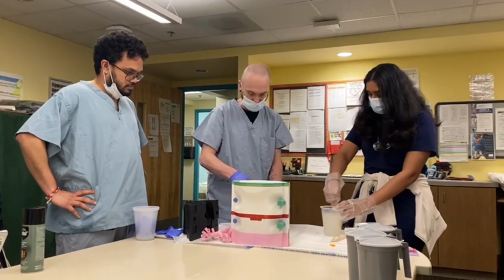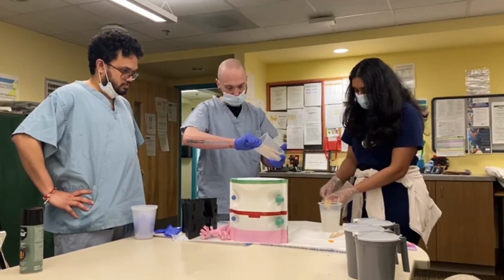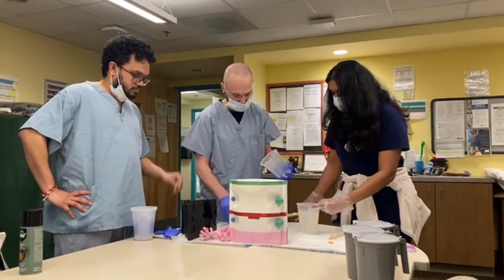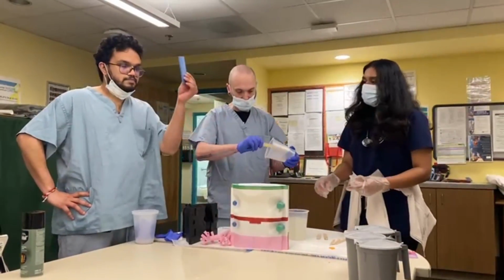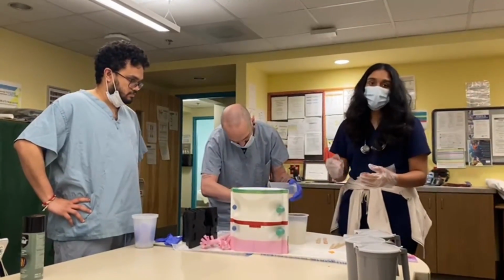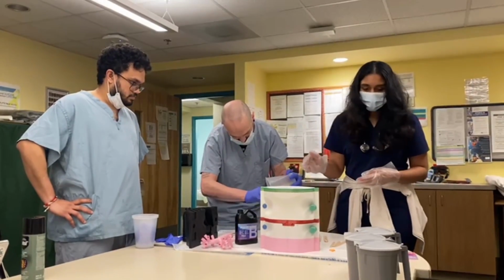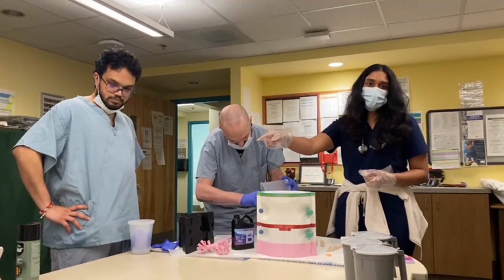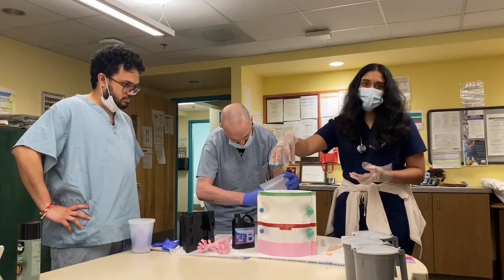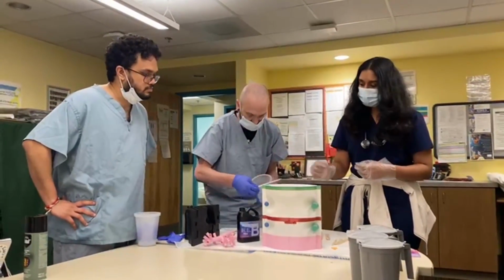Along with the rest of the 3D printed model, we also printed a few releasers into the side of the model. That is over here. They will help with getting the silicone out of the mold. So as we talked about earlier, we used a releasing spray, which you spray on the inside of the mold, and that helps the silicone just slide right off.